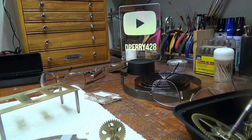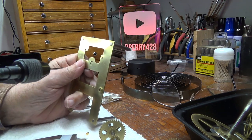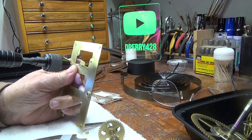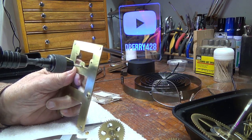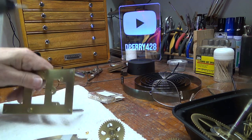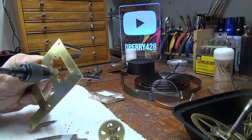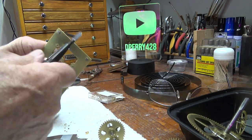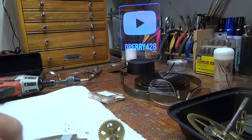But what I'll do is, doesn't matter whether I ream this out from the inside or outside, because this isn't a tapered reamer. When it's finished, it's parallel. Chamfer tool, chamfer the edges, getting burrs off of there, and then we're going to go ahead and we're going to put that bushing in.